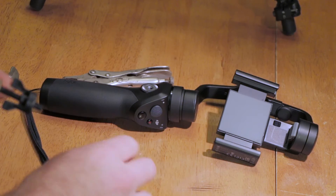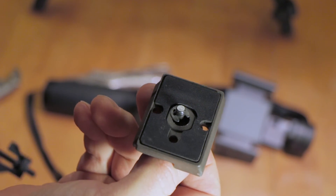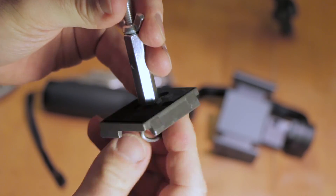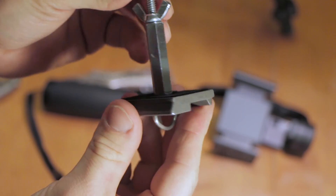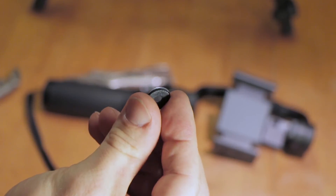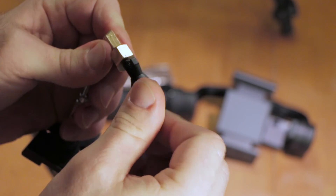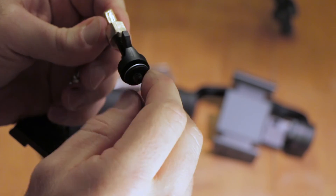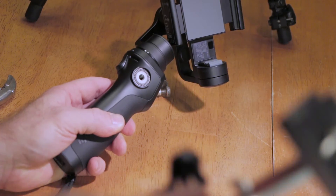The device is pretty much done. The bottom piece is what screws into your tripod's camera mount — just screw it right into the quarter-twenty coupler nut. Then take the small washer and place it onto the end of the two-inch set screw with the rubber side facing out. Your device is now complete.